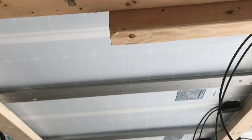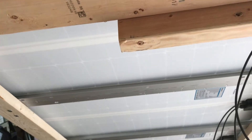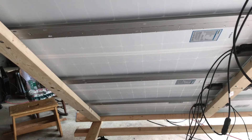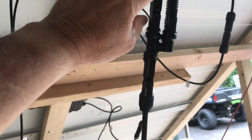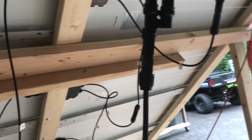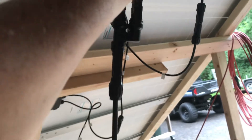Whatever the voltage is in your string — in my case I've got six 20-volt panels, approximately 18 to 20 volts each, so the nominal voltage is 120. When you connect it with the 2-to-1 Y, that keeps the voltage the same by connecting the two strings that are in series. Then connecting those two strings in parallel keeps the voltage the same while combining the current.